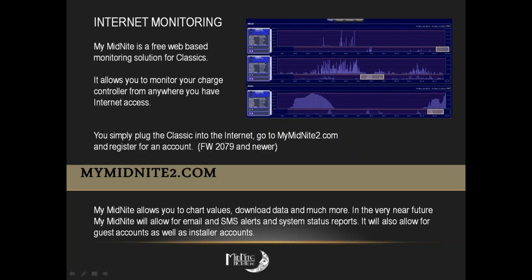Quick note on that. 2079 actually has a bug in it, so I would suggest that anybody that hasn't updated yet and wants to get on the new My Midnite, reach out to us for the beta software. There was a day counter in 2079 that expired at 9.9 days, and the Ethernet would lock up. So we do know that, and we have fixed that. So if you're getting ready to update today after this webinar, give us a shout and we'll get you the new firmware.